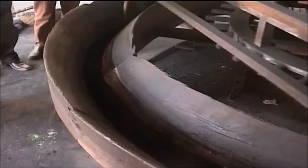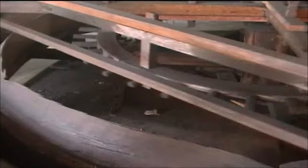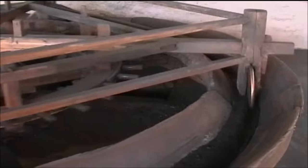Four brass wheels rotate in a large wooden V-shaped trough for several hours until the powder has attained the desired qualities of strength and fineness. The mill is beautifully constructed out of wood with lantern-style gear teeth and a heavy wooden shaft powered by an electric motor located in an adjoining room.